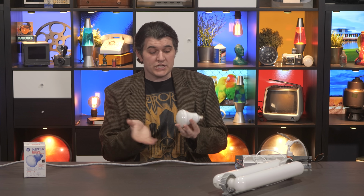This was a problem because as the ferrite material increases in temperature, its magnetic permeability decreases, which limits the strength of the magnetic fields it can produce, and thus the amount of power it can send into the gas discharge. That reduces both brightness and energy efficiency. Philips solved that by incorporating heat-conducting material into the design of the ferrite core's stem, which, by the way, they referred to as the antenna. From what I can tell looking at patents, GE didn't solve this at all, but since this lamp only operates at 23 watts, the induction coil probably never got hot enough to matter.